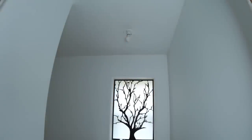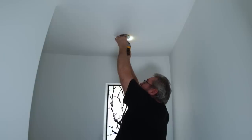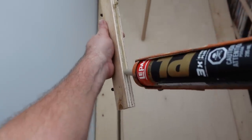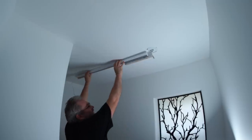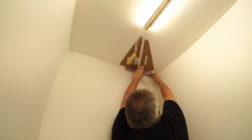With the platform built, I could start with the light fixture. The new one is going to be two 48-inch LED bulbs facing in opposite directions towards the sidewalls — I figure they'll throw the light sideways and give me the effect of the sunburst. Because there are going to be spaces between the parts, I'm going to paint everything that I think will be visible as I'm putting it up. Another thing I did before getting started was make cardboard templates to locate the blocks that the petals or rays will get mounted on.